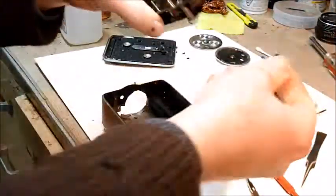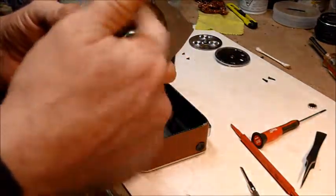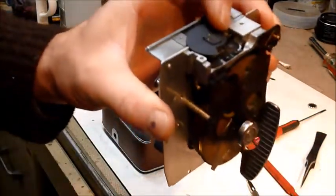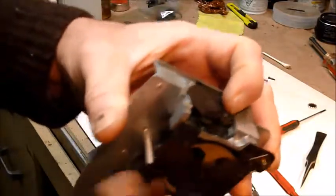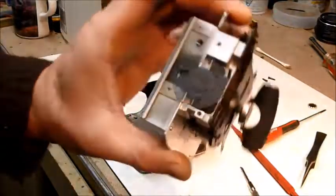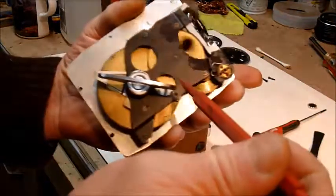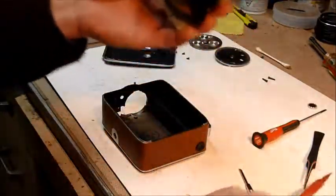I'll wind it up so you can see what it does. If you want to do this yourself, you can stop the rotary shutter by very gently just putting your finger in the way of it, wind it up, remove your finger and let it go. Then you can see what everything does — all the moving points where gears, pins, bearings, and shafts all work. Pretty much anything that moves, put a dot of oil on it and that should improve its performance immeasurably.